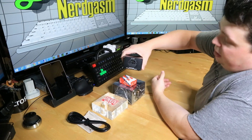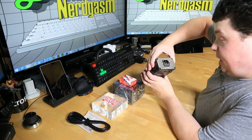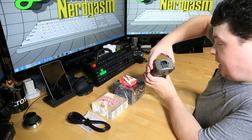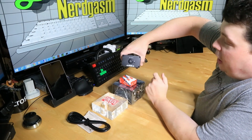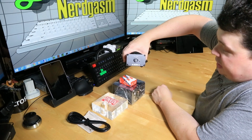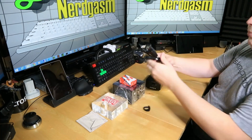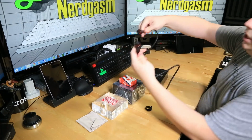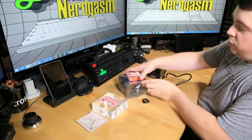All right, so on the back of the power supply, we have the AC inlet. It's awesome. It has a slow blow fuse. Let's see, 400 milliamps at 115 volts. And then here we have the DC output, which is the dangerous side that kills you. And then it came with the cable right here. And this is to transfer the DC power from the power supply to the actual amp.